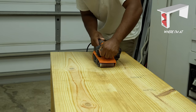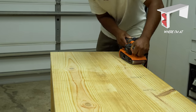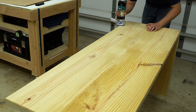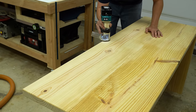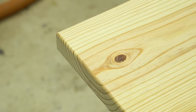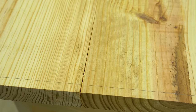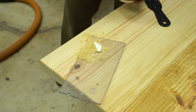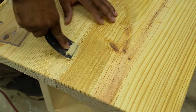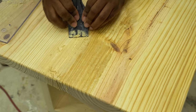This is some rough lumber so a lot of time was poured into sanding the top down. Travis was interested in this desk for his daughter so I let him get a piece of the action and do his first routing job. The round over looks pretty good but most importantly it's kid friendly. I may have taken the clamps off a bit early because I don't recall seeing this gap. But that's okay — we're going to fix that with sawdust and some wood glue. This worked but the sawdust was soaking up the wood glue making it hard to push, though it's a quick solution and I didn't have to go buy any wood filler.